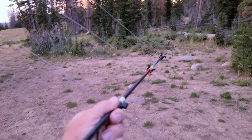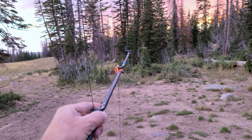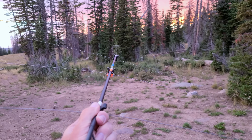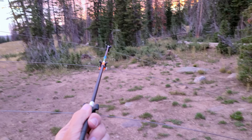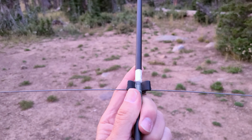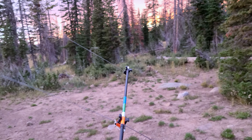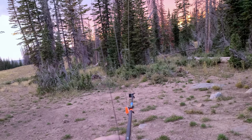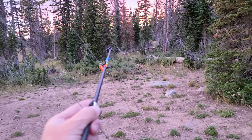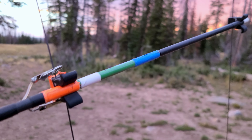What I'm going to be using for this next two-meter contact is a homebrew YAGI. There was a YouTube video I saw probably eight years ago or more where this young man made this antenna and gave me the idea to extend it on for my camping trips. This is model railroad wire. It's flexible enough to handle being held this way, and the wire has memory to it so they stay and hold the position. I use some archery clips to hold this in.